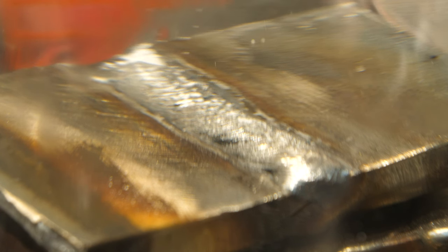It catastrophically broke, which is not too unexpected, primarily because of weld defects - the undercut. Hopefully your safety squints were engaged on that one. Now we have a second one that appears to have more weld, though there's a little bit of a cold toe. The toe down here is a little bit cold. Let's chuck this up and see what happens.